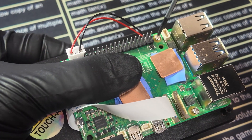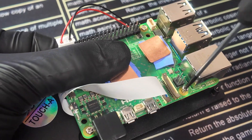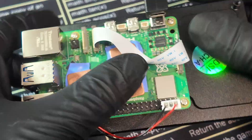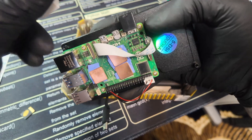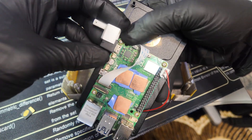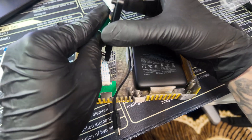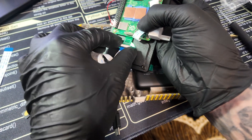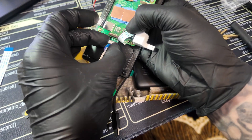We can mount it in place. We've aligned all the screws and mounting holes — use the screws from the display box and screw them not too tight, but tight enough where there is no give. Now that we know everything's in place, we can put it into our enclosure. Grab the push-pull mechanism and place it over the USB-C adapter. Then grab the SD card extender and, moving the ribbon cable to the side, plug it carefully into the Pi without scratching the pads.